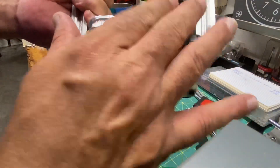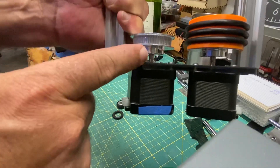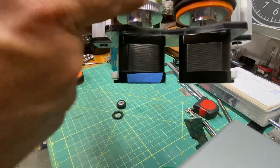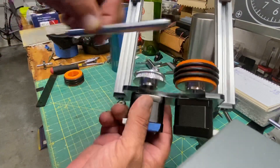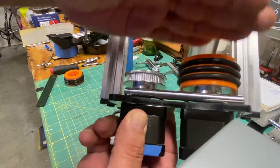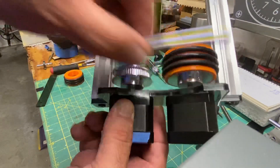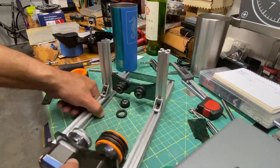When you are fitting these pulleys, be sure that the distance from the base of the plate to the base of the pulley is exactly the same on both sides. In my case I use some rods I had handy to make sure both pulleys are perfectly at the same distance from the plate. That will prevent the object from slipping when it's turning.